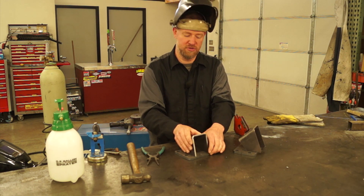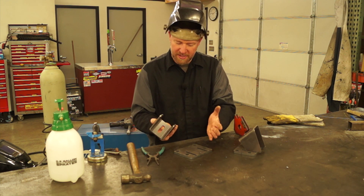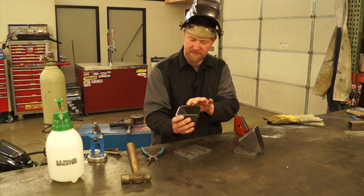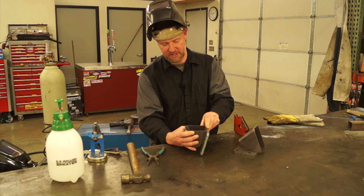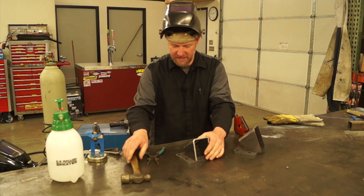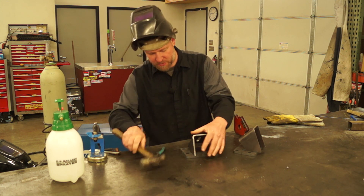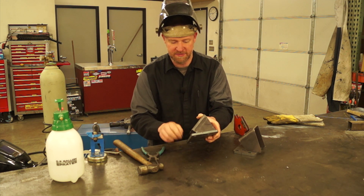It's always as you are sitting in the driver's seat. These are pretty straightforward — they have interlocking tabs. The way you get them assembled is that this downward sloping portion will flush out with the top of the mount. You take your mount, put it in there like that, take your hammer, and tap it all the way in until it seats down against this plate.